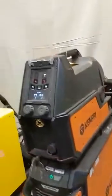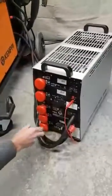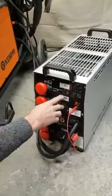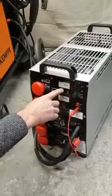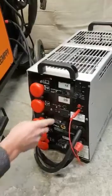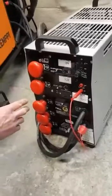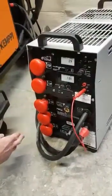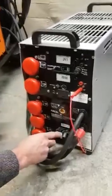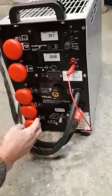You can see what the power source is doing — the power source says 23 amps. We can add extra load as we add more load. Because this is a constant current power source, the volts has come down but the amps has remained pretty much the same. As we go even further, the power source is going to shutdown mode because the voltage has gone far too low for the output the power source is set to. Just take the load off and pop that small load on again. Now we can start to add some fine load — this is the fine switch which gives you six settings in between, so you can get in between the different loads.